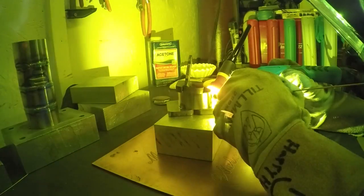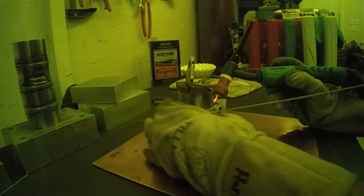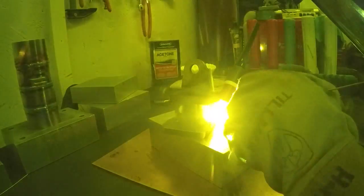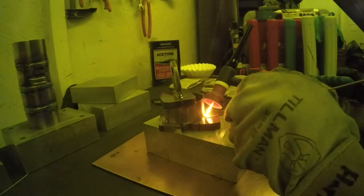I don't consider using the monster nozzle cheating — I threw that in with the kit. My main idea was to really extend out the tungsten and get my hand out of the way. I was welding very uncomfortably, far back from the part, so you can get the arc shot and get an idea of how fast I'm feeding filler.